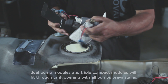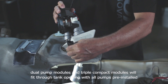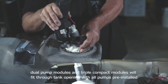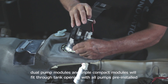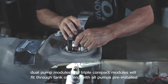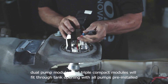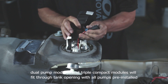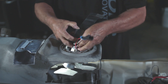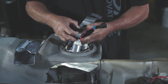To install this in the tank, first drop in one of the pumps and then drop in the assembly. Make sure you get the filters tucked down and then just wiggle it back and forth a little bit and you will find it slides in. At this point, we are going to be pulling up the other pump and it should align just like so. I am trying to keep the alignment on this face and make it parallel. Put your thumbs on top and grab a hold of the nut and push that cartridge up like that.